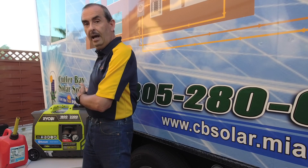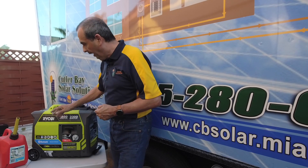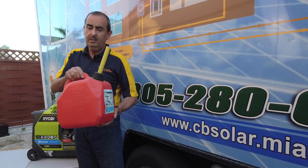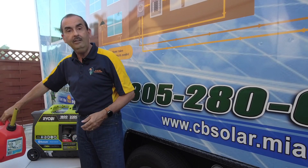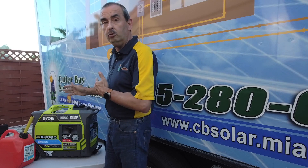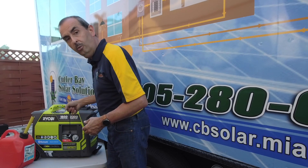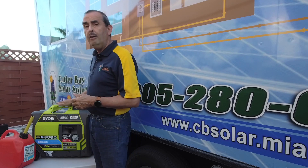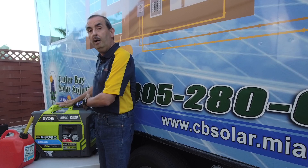It used to be that you had to rely on some type of generator. I have here the RYOBI 1800 series — a great unit, as long as you don't mind smelling gas around your house. Make sure you have enough of it for extended outages; this will run you around three hours. Calculate how many cans you'll need to run, say, ten or eleven days. You need to do all the maintenance and keep it ready, because it's mechanical in nature — if the pull cable doesn't work, spark plugs aren't in shape, or you don't have enough oil, many things can go wrong. When you run it for an extended period it overheats and you may not get all the wattage you need. Very unreliable, but it is a source of power.